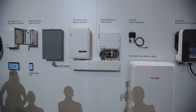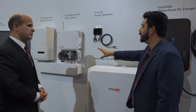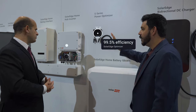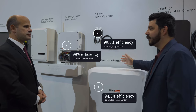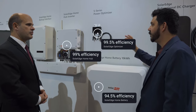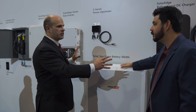The whole system comes together with your solar module connected to the power optimizer. That DC power comes down into the inverter — almost one for one, around 99% efficiency at that transition. It comes into the battery at around 96–98%, and the round trip is in the 96s. Then you're going back out to the house. All of this being DC coupled means we can do all of these things without requiring a main panel upgrade.